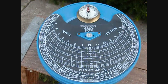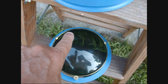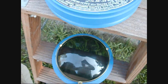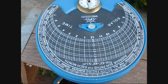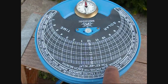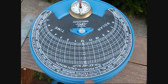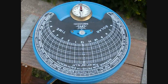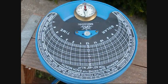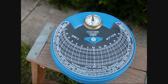Next I'll put a reflective dome over the top. You can see the dark areas will reflect shaded spots, while the light areas show where the Sun is coming through. You use this along with the chart to predict what percent of Sun you'll get through every month of the year at this location. You put different grids on based on latitude — I'm in the 43 to 49 north latitude range. You also make slight adjustments east to west based on magnetic heading versus due south, and where I'm at it's very close to the zero magnetic declination line.